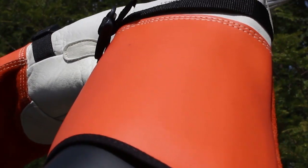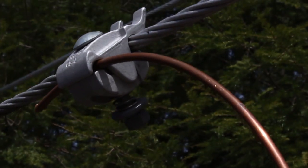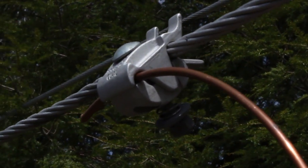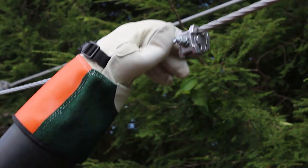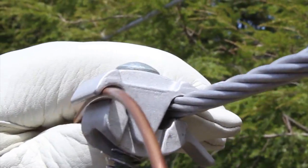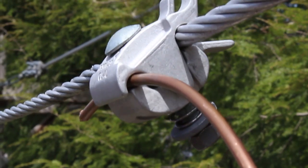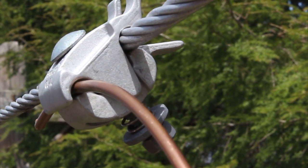Notice how the oxide inhibitor stays in the connector. With a standard parallel groove clamp, there is nothing to hold the conductor in place and sometimes the conductor falls out — making installing a standard connector on the main line even trickier. With FastTap, the duckbill acts as a guide to easily snap the connector onto the main line, while the lineman assist holds onto the tap conductor.